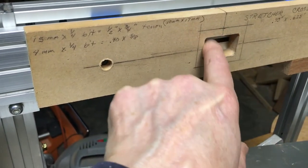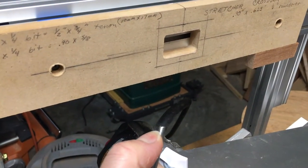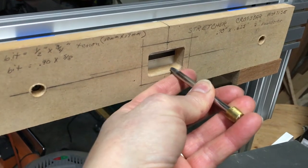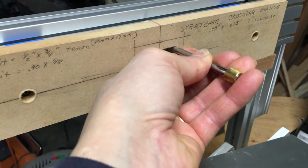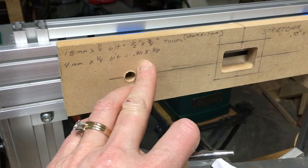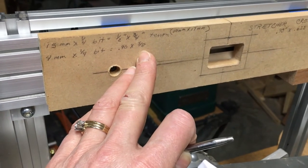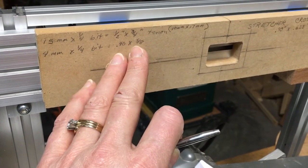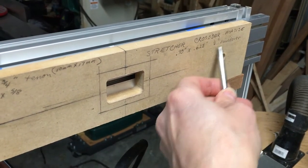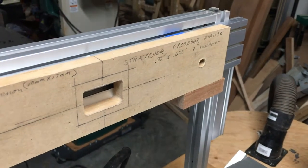For the outside, which is the housing mortise, I can use a four millimeter follower right about there, which comes to about four millimeters. The full thickness is five millimeters. So if I set this in the hole right to about that edge, that'll be my four millimeter that I'm following in the hole. That'll give me, using the quarter inch bit, the hole for my crossbar, which is actually not a full inch — it's 0.90 by five eighths of an inch. It just happened to be what the smallest of those was; I would prefer it if it was a full inch, but this is a good proportion. I've also marked this as my stretcher crossbar mortise — the final size of the crossbar mortise using the one quarter inch round over on my crossbar.